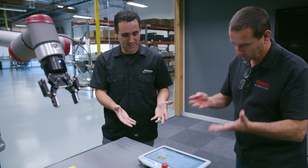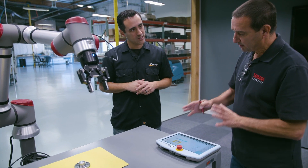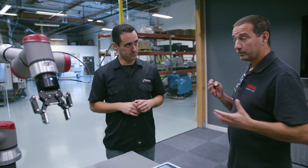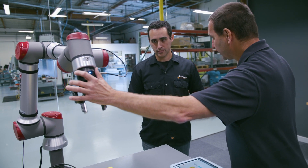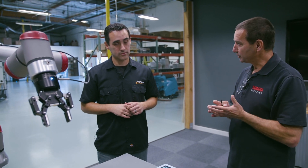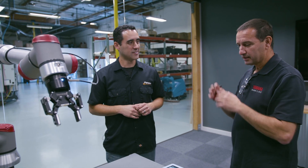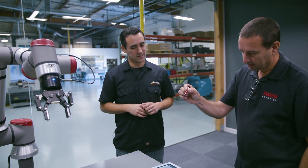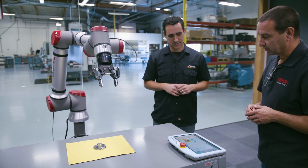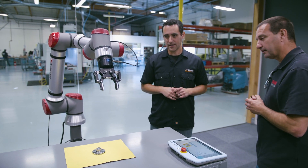This is the pendant, but it doesn't look familiar to me. Universal Robot is unique in that it has the ability to accept apps, just like our smartphones. Once you install the hardware, you plug it in, install the app, and everything automatically sees each other and talks to each other — no two technologies interfering or conflicting. They communicate seamlessly through a wizard here. You use a stylus, go right through each step, and teach the particular part you're interested in. In this case we have a robot that's just looking at that part — it's going to pick it up and place it somewhere in this area.